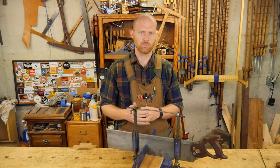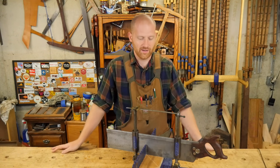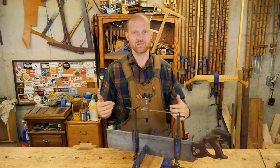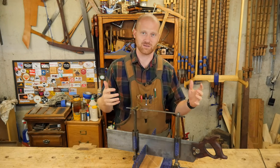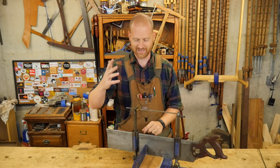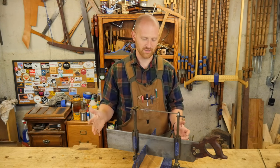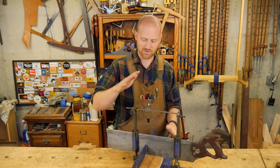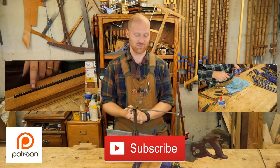It was kind of fun because it's a rare quarter-24 thread that really doesn't exist anymore — most places have stopped making it since the 1940s. But a new friend of mine from Europe said he could make one, and he actually had a hand-cranked metal lathe for cutting screw threads, so he was gracious enough to send me one. I got it up and running, but the only problem was that in putting it together I knocked it off the bench and broke a cast iron plate. I was back to square one until I realized I had a piece of metal that was the exact same size — I could put a dimple in it and it did the exact same thing. It looks a bit funky at the moment, but it's up and working.